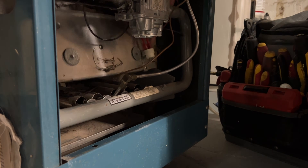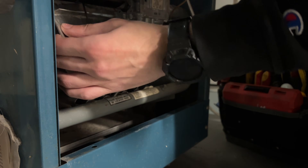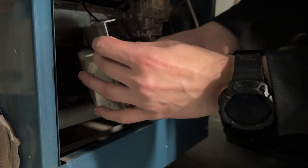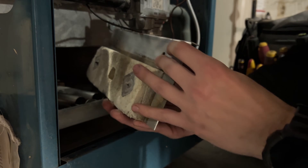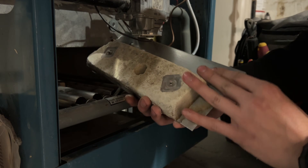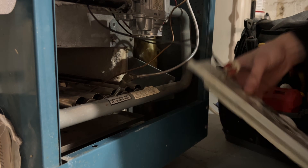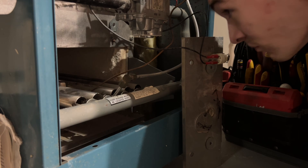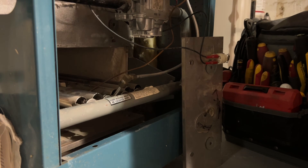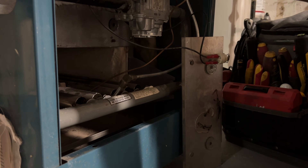The first thing we're going to do is turn the power off. Carefully take out the combustion chamber front plate with the associated rollout switch. Light it off to the side. First we're going to verify the problem — try relighting the pilot; hold down that button.